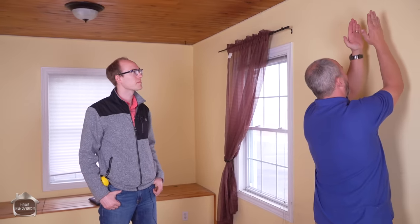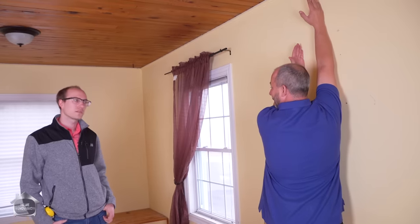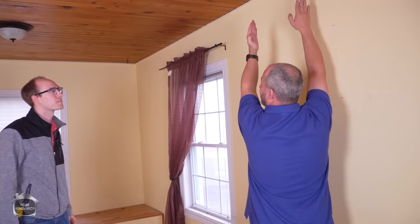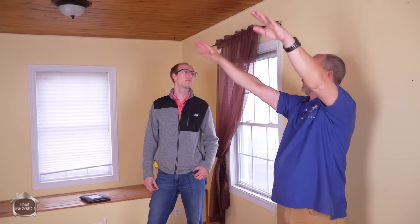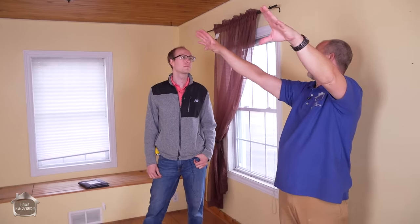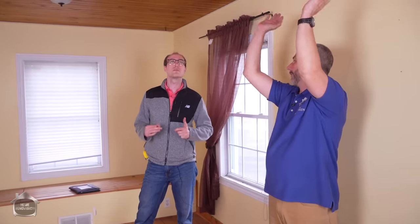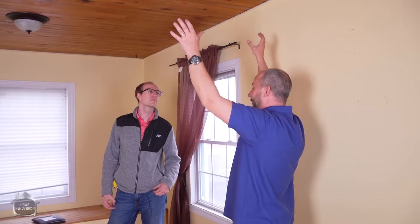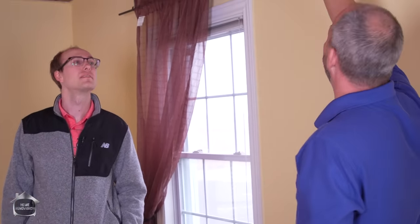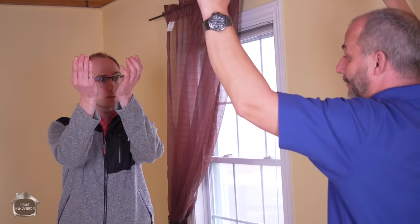If I have a post the same width as my beam, do you want to have another 2x4 or something traveling up past the beam so there's no rollover? That's also a great idea — it's important when you're underneath structure. In this situation I'm planning on cutting all the joists out, so I'm going to need an interior wall. Usually within two feet, something that's measured and cut to fit, then carry the load. I'll slide the beam up, add joist hangers, and then jack them all in. Once that beam is in place, there's not much risk of rollover.